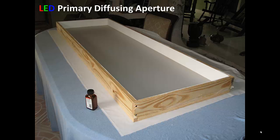Now you have a taut strip of vinyl film across the middle between these two sides. Then you go to the other two sides and do the exact same thing. You pull it up, not real tight, but just so it's smoothed out, and then push it up against the wood, smooth it out, and walk to the other end. This one you pull a little snugger and then press it in there. Now you've got a nice taut surface between the middles of both sides. That still leaves the corners, but you get the middle ones done first.